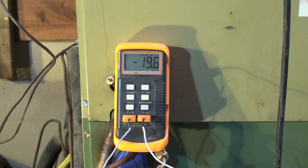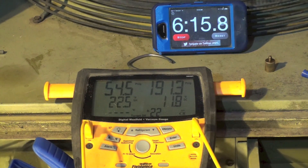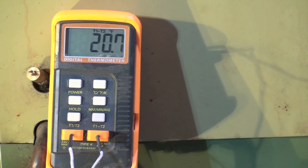I'll go ahead and switch those two temperature probes so we have a positive reading instead of a negative. At six minutes in, superheat is still in the 20s, dropping down to 22, and head pressure is going up a little. The temperature split across the coil is now at 20.5 degrees — about a degree more, and it is kind of settling down.